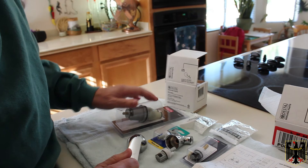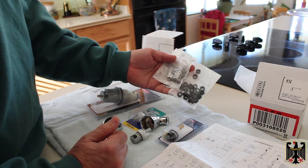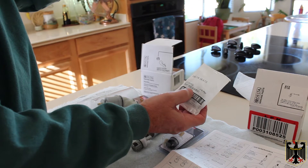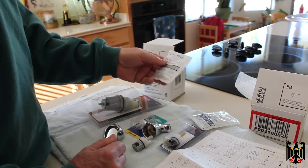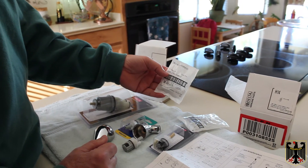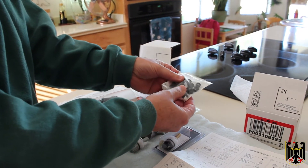That's all I wanted to cover, but also be aware — if you have as many faucets as I do in my house, you can buy these repair packs in bulk from Delta. The seats here are Delta repair part 1806 MBS, and I think that stands for master builder supply or something. The springs are DRP 342 7 MBS. This is for master builder supply, but I use so many of these I always replace the springs and the seats whenever I'm doing any faucet work.